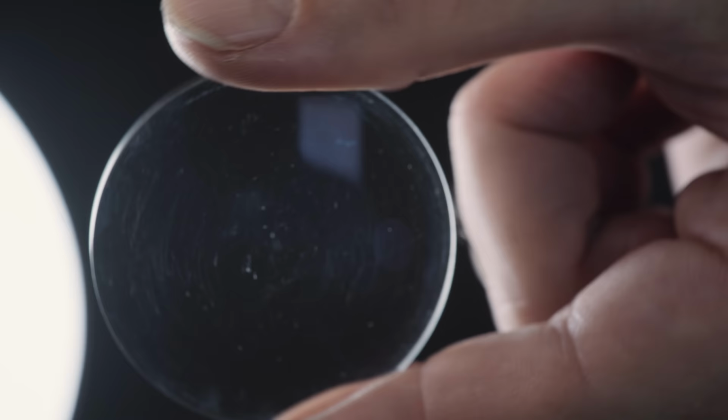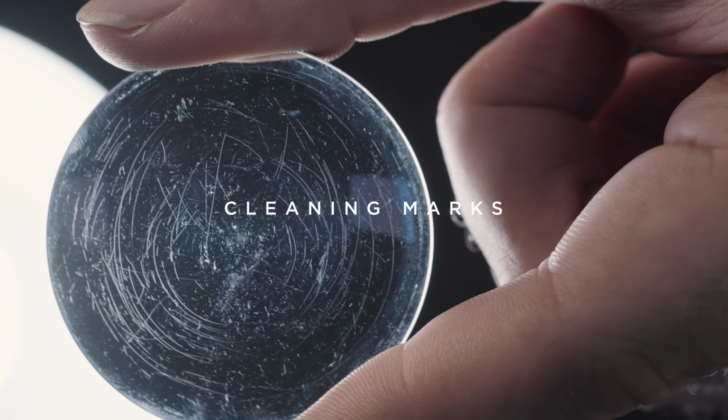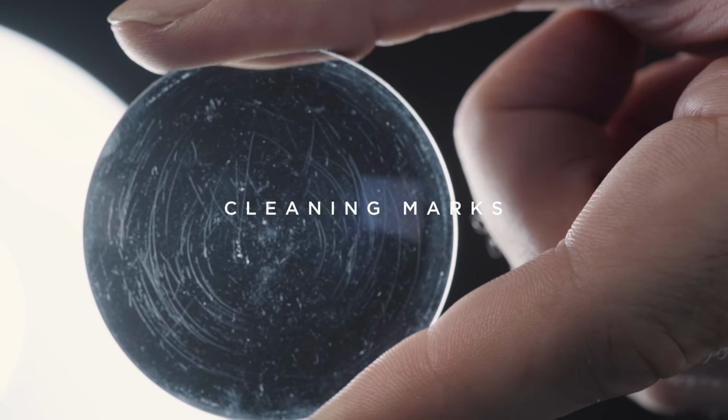Cleaning marks are very small scratches that are predominantly circular. They are caused by particles on the lens or in the cloth while the lens is cleaned. Cleaning from the inside out and with little pressure reduces the risk of leaving marks. And of course, the surface and cloth need to be clean.